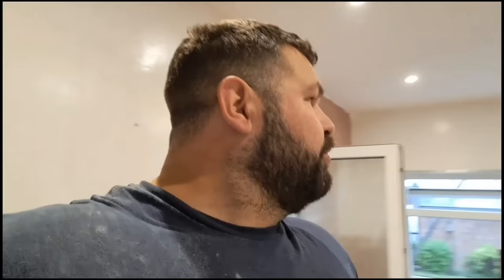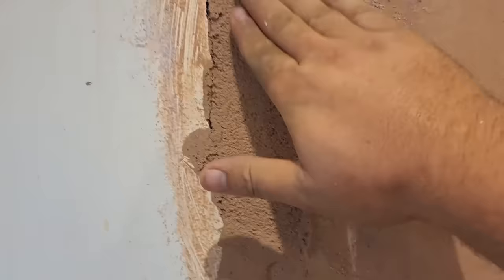All the SBR is on, everywhere's sealed, all the beads are on and all the chasers are filled out with bonding. It's literally just a case of waiting for the first part of the wall - the first section where we put the SBR on. As soon as that starts to dry in a little bit we can get skimming, so not long now. The time is basically quarter to two.